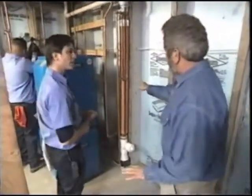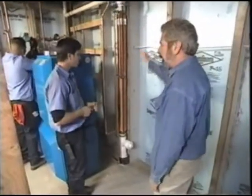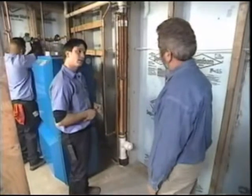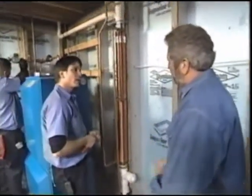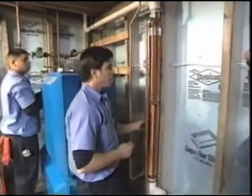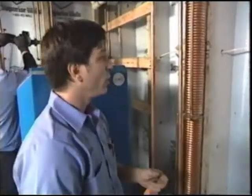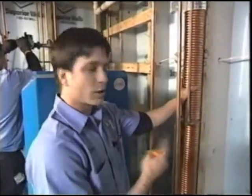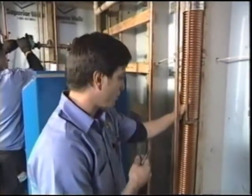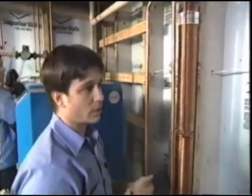Good morning. This is something I wanted to look at closely, because this is a pretty unusual feature that we're putting in the house. And it's simple, but it is new technology. What do you call it? It's a wastewater heat recovery unit. It utilizes the wastewater from, say, the showers or the kitchen sink, the dishwasher. All the water that's going down the drain clings to the wall of the drain pipe, transferring the wasted heat that would actually go out to the city sewer.